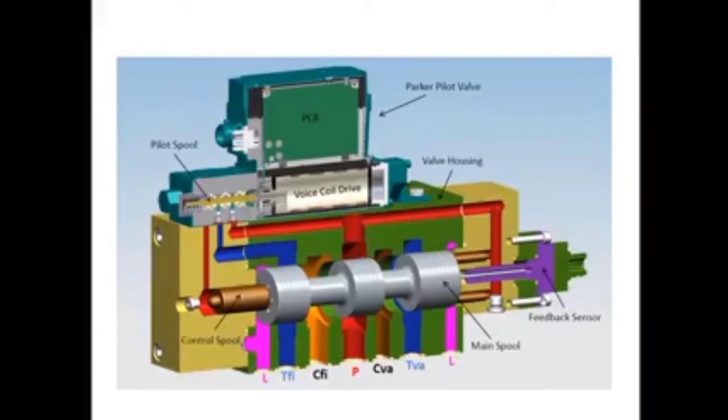We can now identify all the items inside. The most important piece of this equipment — for which oil quality must be carefully maintained through sandwich filters — is the main spool. As mentioned earlier, in case of power failure this spool piece will go to the safe position, which means no fuel injection and no valve opening. It returns to a natural, safe state.